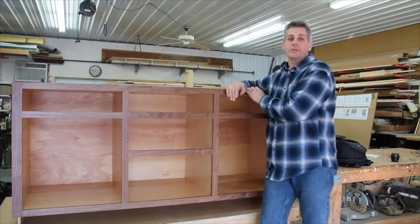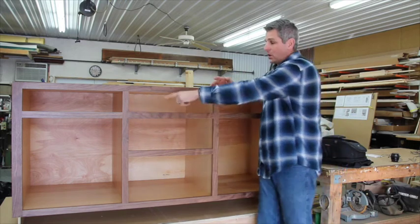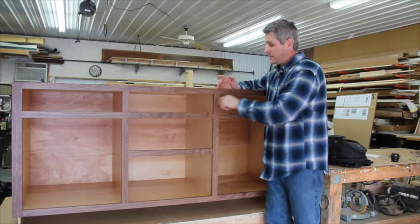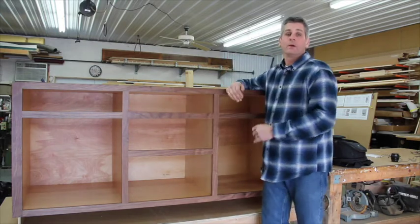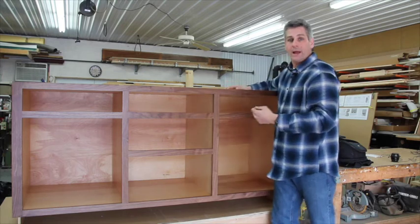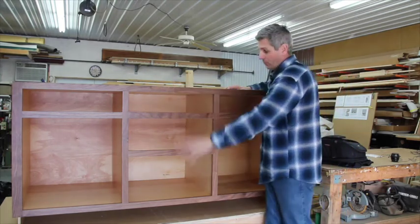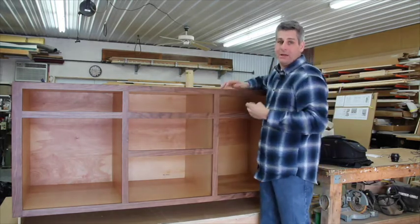Height, you can go up to 42 inches. When you change from a standard height, these top openings always stay 5 inches. So if you want to go to a 38-inch high cabinet, these stay 5 inches — what gets bigger are the lower two openings, and your door openings are going to get taller. When you change width from 48 to 52, all the openings stay equal — they don't keep the middle one the same and flex the outside ones. All openings will stay symmetrical and equal, so be mindful of that.